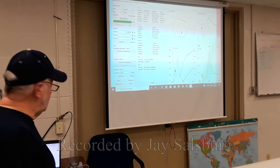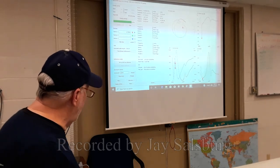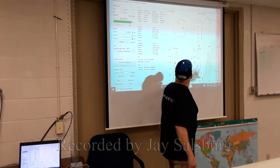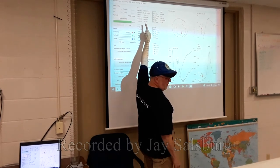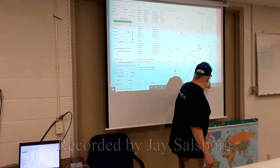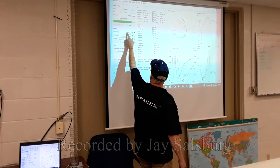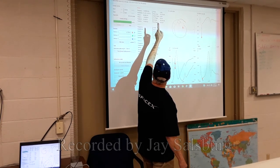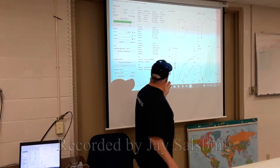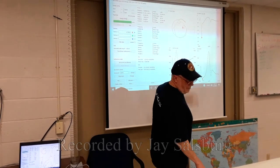So ask me questions, please. I can't tell by looking at the graph there. What frequency is it resonant on right now? The marker here is shown here. Can you see these stats here? It's the scale along the bottom. See the scale. It's 16 megahertz. So the red marker that is established here is 4.6 megahertz, and it's showing 52 ohms. And you can move the marker so you can know what it is at other places. The SWR is 1.0, okay?